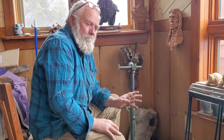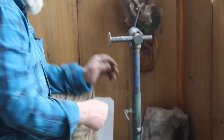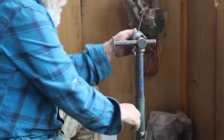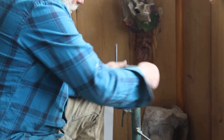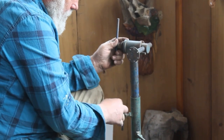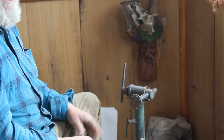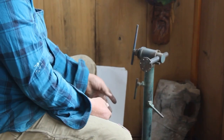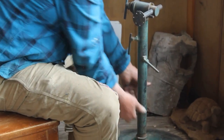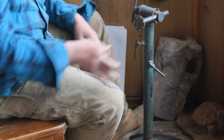When I was teaching off from these I would always warn my students about a couple things, because it would invariably happen every class. First, guys wouldn't get these tight enough and they'd be pounding away, and if they didn't have them tight enough the arm would fall down. I've had people pinch their fingers that way. They're not foolproof vises, but they do come all apart — this screws out of the bottom. I even used to weld two pins down here so you could set your feet on those pins and unscrew the whole thing out of the bottom.